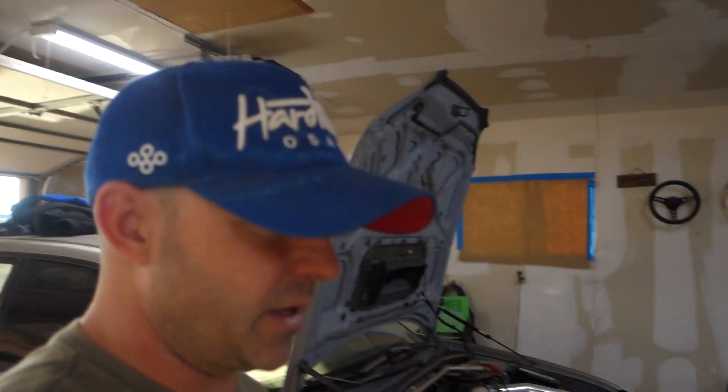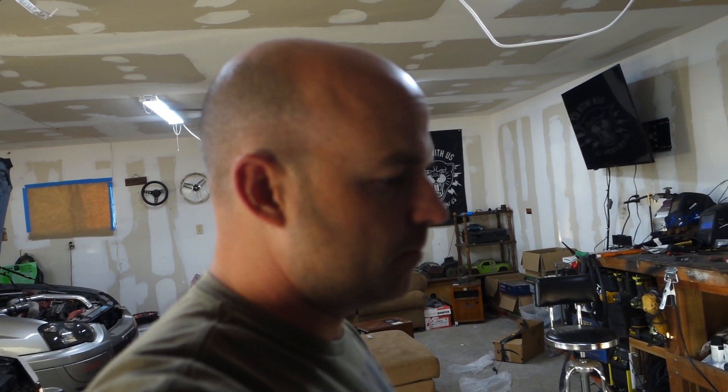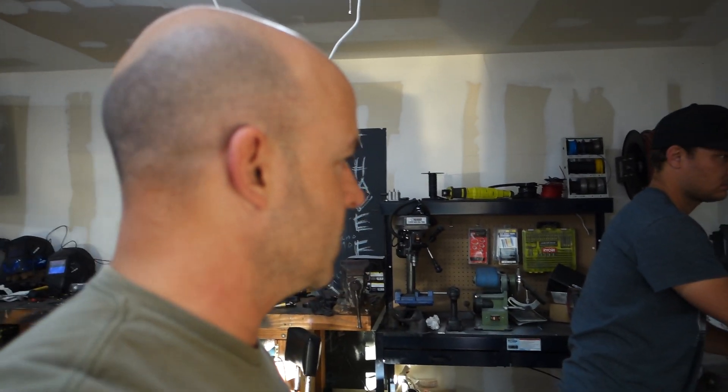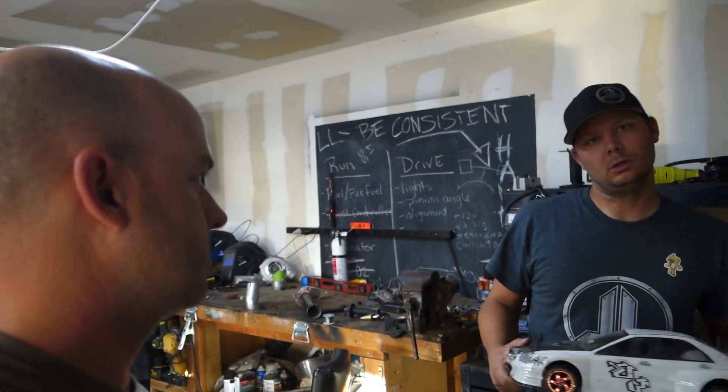So if you've been watching our recent videos, you probably know that the RX-7 is off getting tuned by Owen at Hog Speed. When the RX-7 is tuned and running and I can drive it around whenever I want, I'm going to put a turbo on the hardbody. In the meantime, we figured we'd go ahead and modify the MAF housing and put an elbow on it because it's going to need that elbow anyways. So we go ahead and do that — we're just running a cold air intake for now. Once the RX-7 is running, we'll put a turbo on and we'll already be ready to do that, which will be nice.